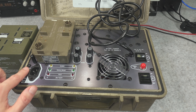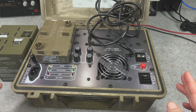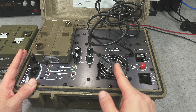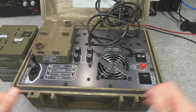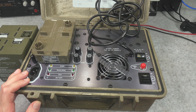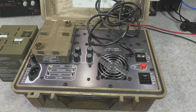Why are we interested in that DC input? Because it's great for recharging from a DC installation — your vehicle or your solar system — so you can skip the AC inverter and get better efficiency. But for that, we have to build our own cable that will mate with those terminals.